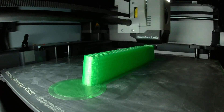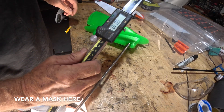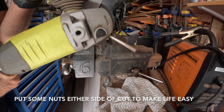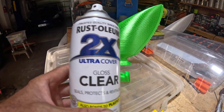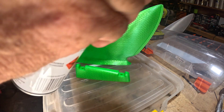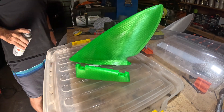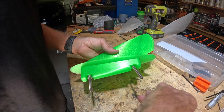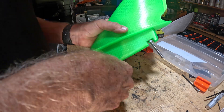Then print the tuttle ensuring the infill is still gyroid. Cut the carbon rods to size, then the 6mm stainless threaded rods. Spray the print with a couple of coats of clear coat and let dry — don't forget the underside of the tuttle. This stops the epoxy weeping out of the pore space between layers while the epoxy cures. Assemble the fin and torque the retaining nuts reasonably tightly. Don't over-tighten the nuts otherwise the tuttle will slightly expand and not fit.